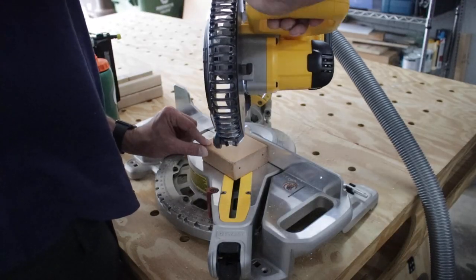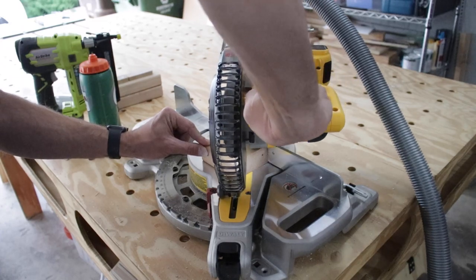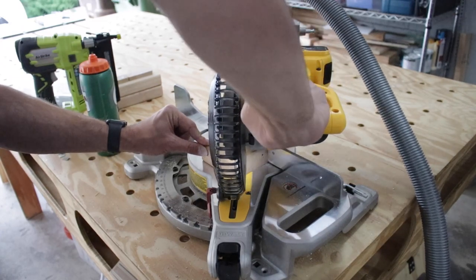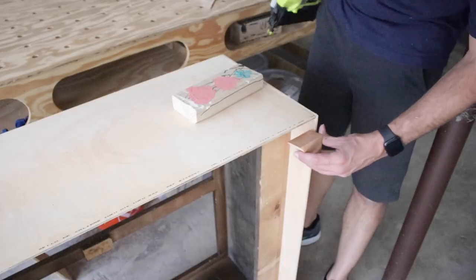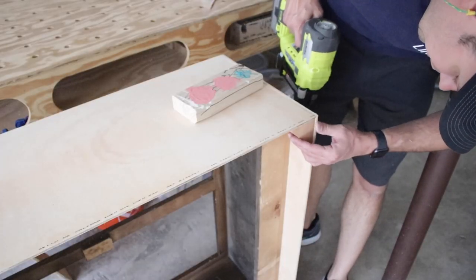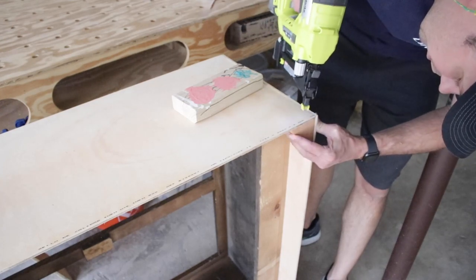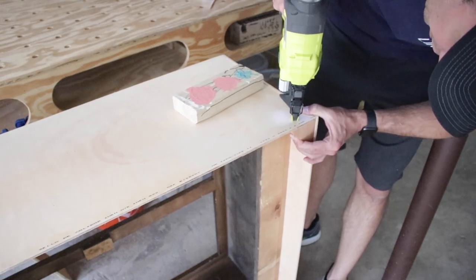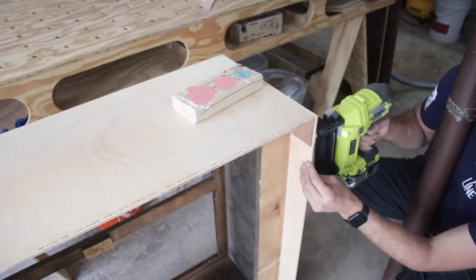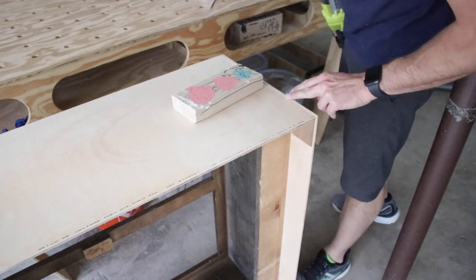Because there's a few inches of overhang, I needed some blocking to connect those rear corners. I grabbed some scrap and cut 45-degree angles on my miter saw to make triangles. They fit right into the corner and give me something to nail to on both sides. I had to be really careful not to nail through and get my finger. Now that corner is nice and secure — I also did it on the other three corners.